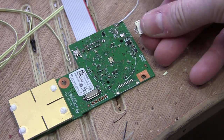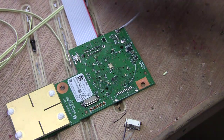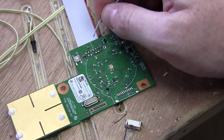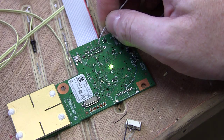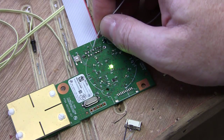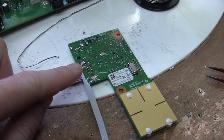This connector is where the touch-sensitive buttons were on the front faceplate. I'd rather just use tack switches, so let's deduce how this works. I've hooked a wire to ground because that's usually how everything works — either ground zero or voltage one. After testing, that one is power. So if we attach a switch to that pin and pull it to ground, it will turn on the unit. Two over is eject. We've attached wires for the buttons we're going to add later — power, eject, sync, and ground. I tested them all and they were good.